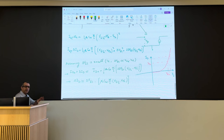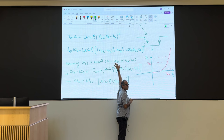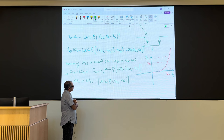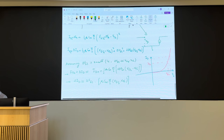Okay? So remember for diodes, our yardstick was VT, the thermal voltage, 25 millivolts. Here for MOSFETs, it's VGS naught minus VTH. If it is 1 volt, delta VGS has to be, let's say, 100 millivolts or smaller. If this is 0.1, you have to have a smaller range for that delta VGS. So it's not like diodes, where you had a fixed number. It's going to depend on your bias. It's going to depend on your device. Okay. So, yeah, I can write that equation. So I have that relationship now. The small signal current over there is delta ID, changes in current. Delta VGS is my small signal VGS, right? And that's the factor that is going to determine the relationship. Let me do it in a slightly different way, and then we may understand.